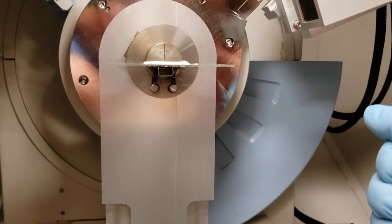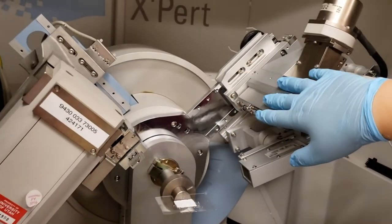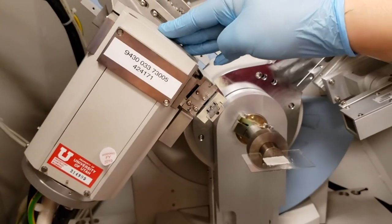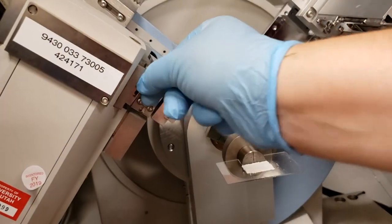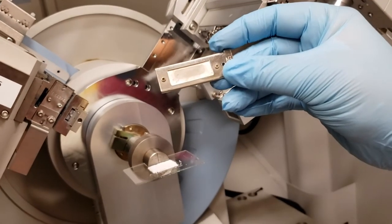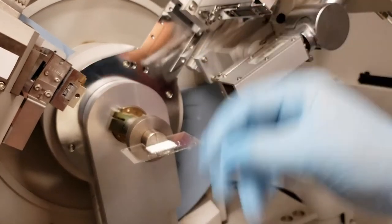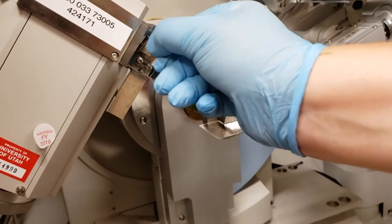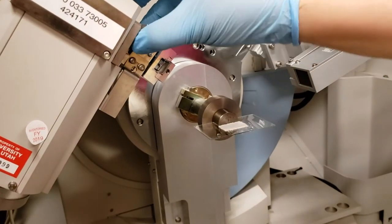At this point, we are going to check the slits and the masks that are in place. This right here, as I mentioned, is the source — it is a copper source, so we use copper K-alpha radiation. We have a nickel filter located right in here. It is easiest to grab out with gloves since it sticks in a little bit. This nickel filter helps eliminate x-rays that are not copper K-alpha 1 x-rays, which helps minimize any double peaks that you might get. It typically just stays right in there — you should not have to remove it at any point, but it is good for you to know that it is in there.